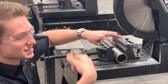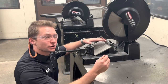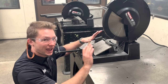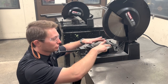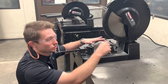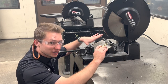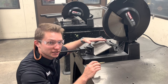This workpiece is going to be more prone to slippage, and if it slips, it's going to rip a bunch of teeth off your saw blade. Here's another good usage of the v-blocks: we've got the rear one removed so we can fit this piece of 6 inch by quarter inch plate in at an angle. That's going to minimize our cross section going through the material. If we had it flat, we'd be going through the whole 6 inch section at once, which would be much slower. We're also maximizing our capacity — it won't fit with both v-blocks in, but at an angle we can get the full cut capacity and maximize the size of pieces we can fit in this saw.